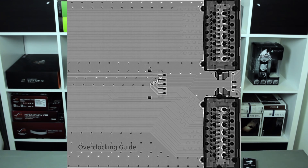Here's another picture. On the right side of the HB bridge you can see all those trace length adjustments on the top and on the bottom, to make sure all traces have the same length.